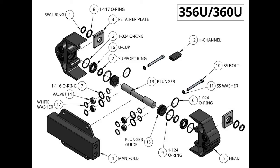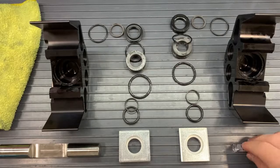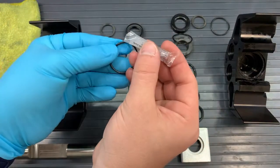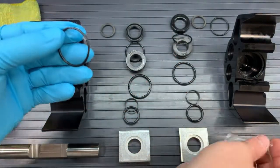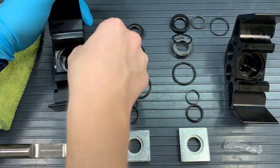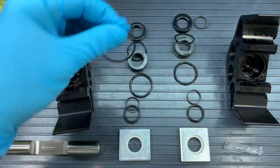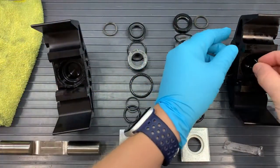Now that we have our pump apart, we're going to move most of the pieces to the side and grab kit A. In kit A, there should be one of the thin O-rings, which is the 024 O-ring. We're going to grab the grease and lube that one up, just a little bit of grease on there, and rub it around with your finger, and we'll stick that O-ring flush inside that seal bore opening of the